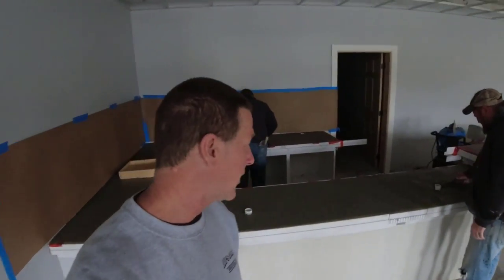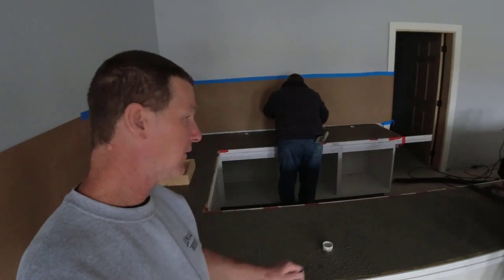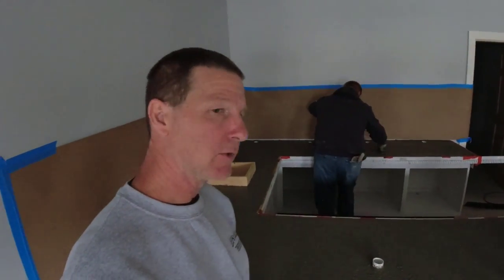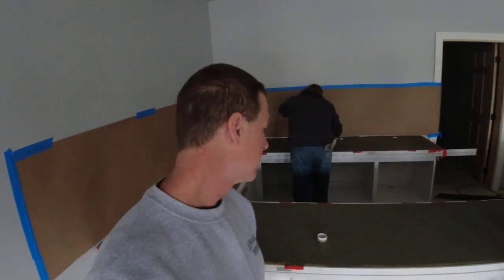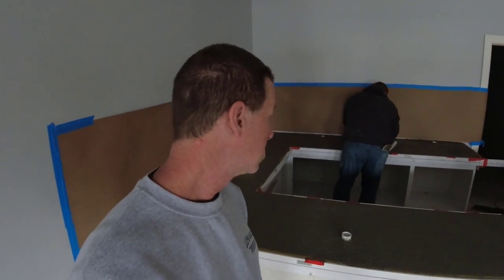All right, so we're about an hour and a half after the pour. It's firming up quite a bit. I think we're about ready to stamp, so we're going to give it a quick mag. I'm going to spray on some liquid release. Liquid release has a little color in it. And we're going to just stamp this bottom section. Like I said, we got our rock texture stamp right over there. So let's get at it.